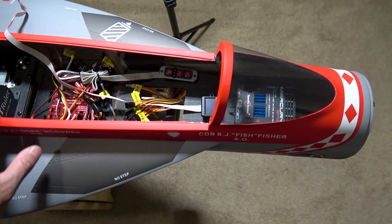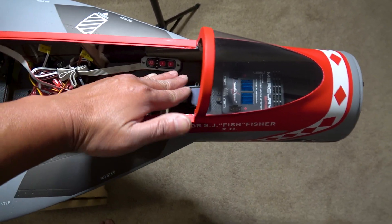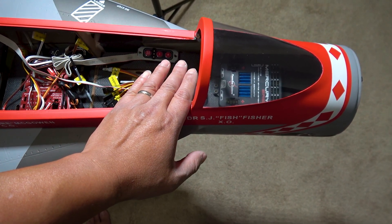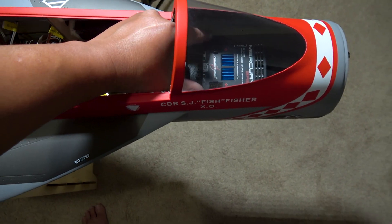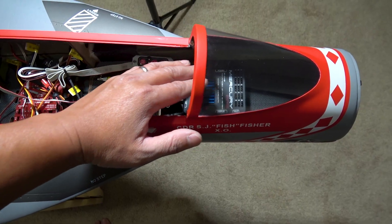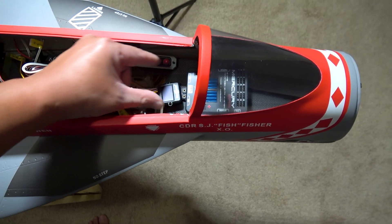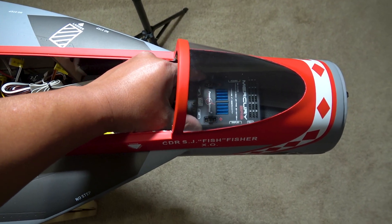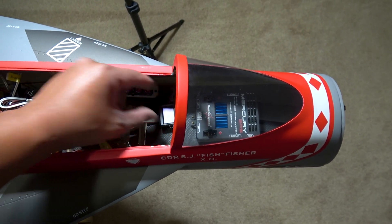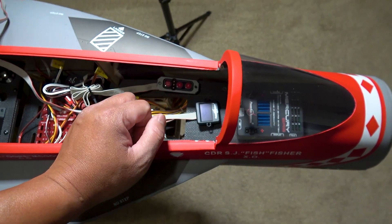The reason why is because once I have the cockpit tray — the front pilot and instrument panel — I need the vertical space to clear so that it sits properly in the fuselage. With the Mercury being back here, the power wires and servo wires kind of get in the way with clearing the cockpit tray. So I have to move it about roughly here so that the wires will clear.